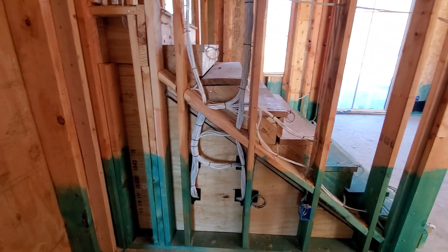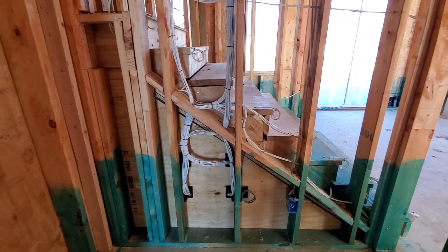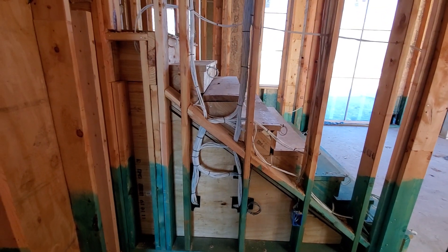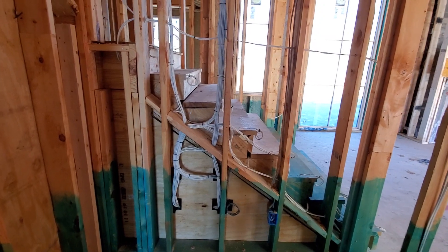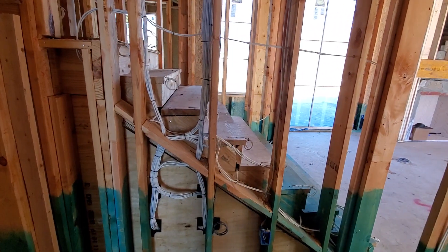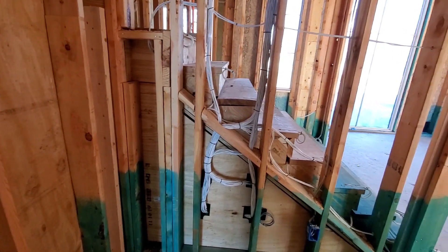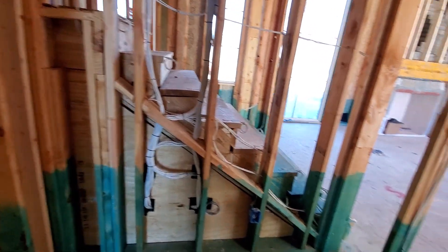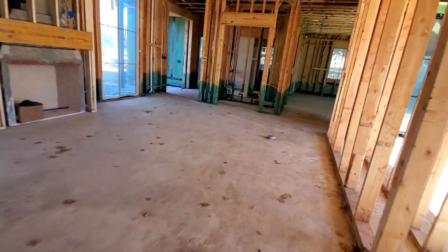To go into a little more detail on the stair wiring — it's like five or six stairs that we can do per power supply, so we run six stairs back to a single box, and that single box then goes back to our home run with a thicker gauge cable to run everything.